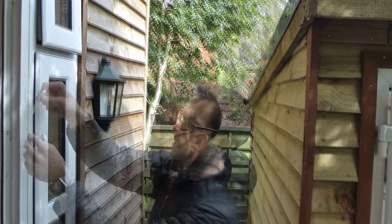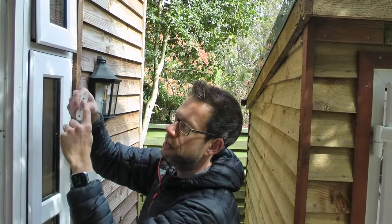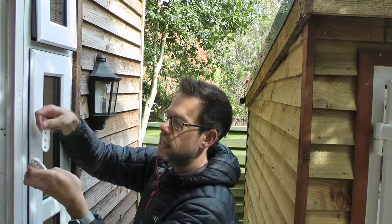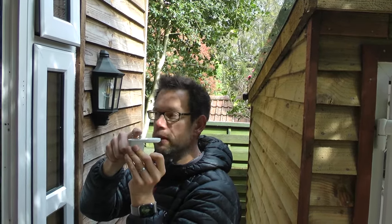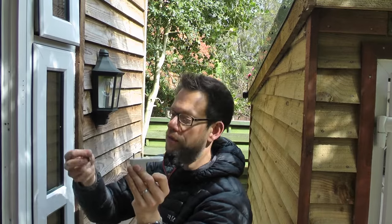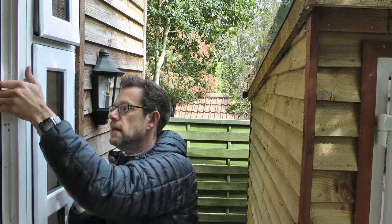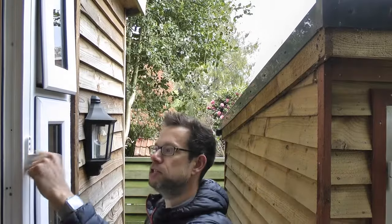The tape goes on first, then making sure that the three - I call it the traffic lights - are up on this particular type of hinge. The ones we've linked to go towards the top. The hinge sits on that, and then the guidance pins - these two require a 4mm drill, whereas the top three screws you just want to use a 3.5mm because you actually want these to pinch and pull in. That's the first hinge base fitted - three more of those to do, and then we'll fit the actual flags to the front of the door.